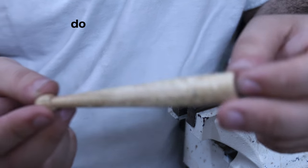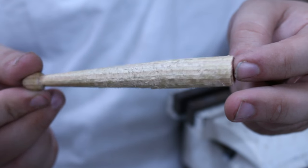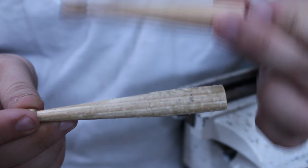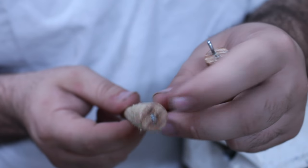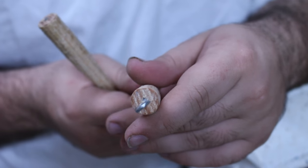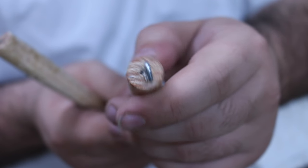Just a word of advice: if you do use used drumsticks, I'd suggest sanding them, because this is what they look like before and this is what they look like after sanding — there is a big difference. And then after you sand them, I'd suggest refinishing them. Also, any sort of hardwood end grain is pretty dense, so I suggest pre-drilling so this doesn't happen, because it happened to me again and I have to kind of jankify this one to make it work.